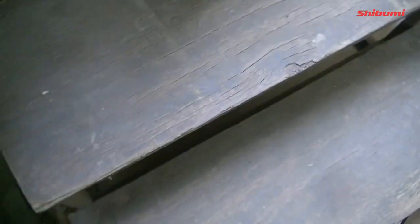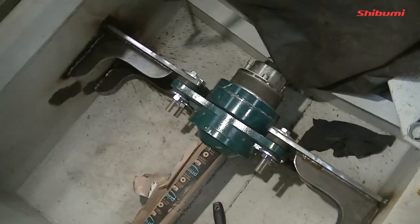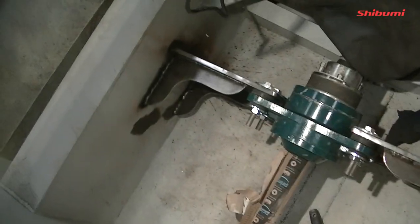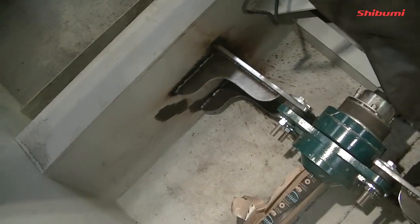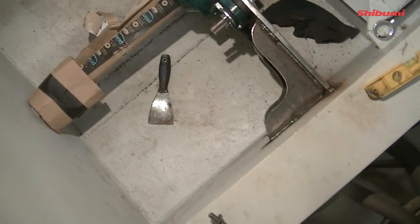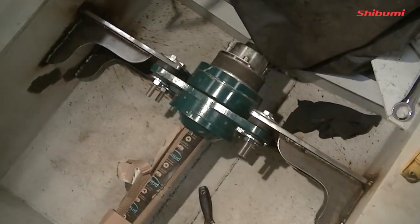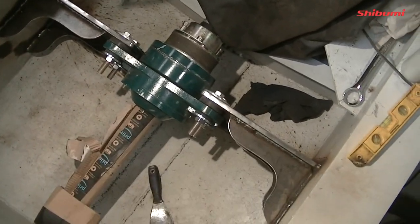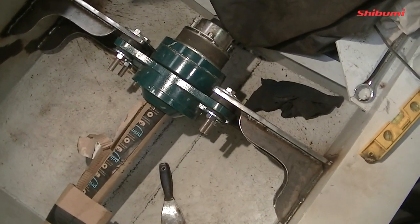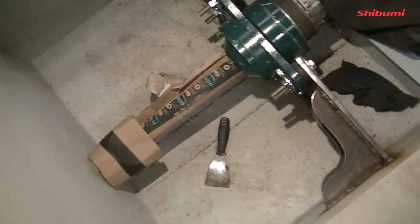So the other thing that I did this morning, and I'm just gonna move into the cabin to look at it from the inside over to the floor. So just give me a sec. So I now have the center bearing. It's fully welded in, it's welded down both sides, and those little boomerang brackets I made are now fitted and welded. They're only welded on the tops, but that's all they really need to be. So that piece of steel there, 12 millimeters thick, will never ever flex or move or budge, and it'll keep us lined up permanently to the shaft.